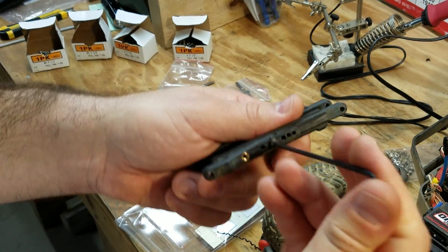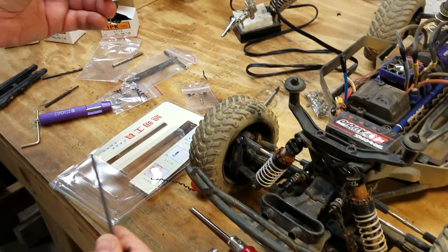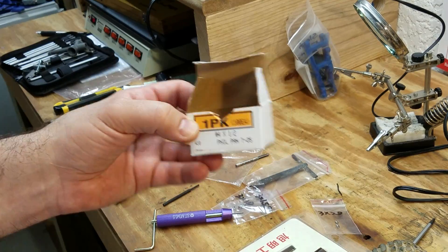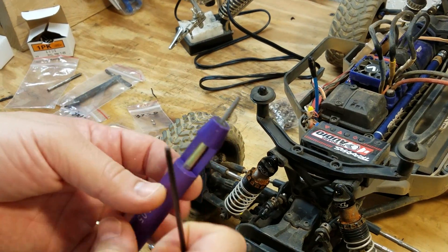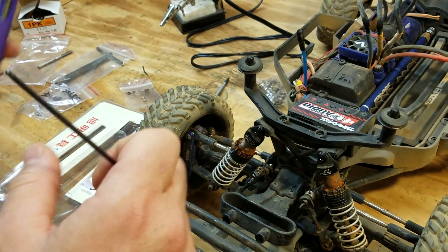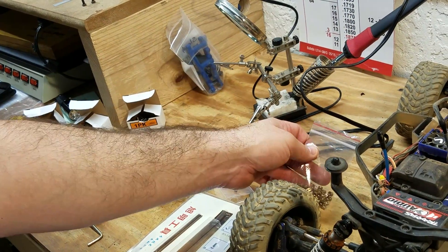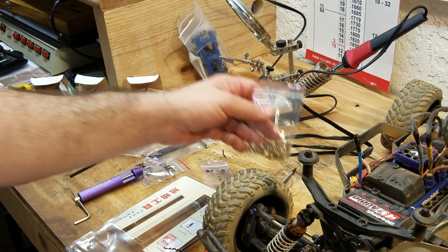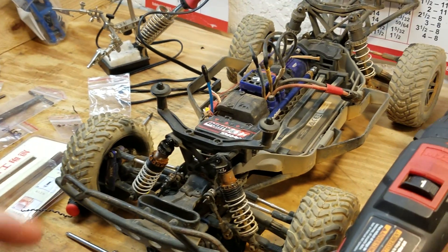So which way do I like best? From a simplicity standpoint, the plastic screws are the easiest — you literally just screw them in the hole and away you go. I like the steel insert — it's a little more sophisticated, more polished, and makes a really strong repair. And the brass inserts probably have their place too, maybe for places where you can't fit the steel insert tool to make the repair. Well, I hope that was helpful — thanks for watching and have a good time.